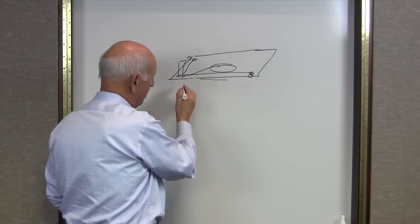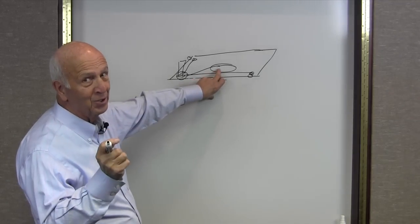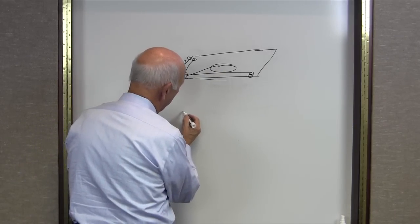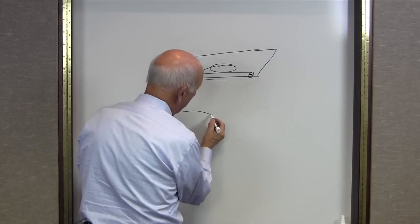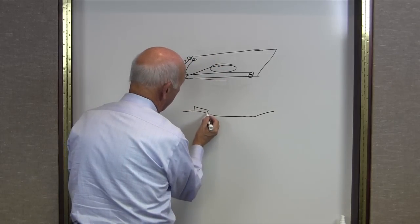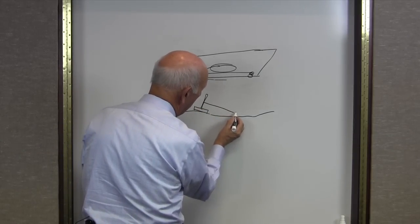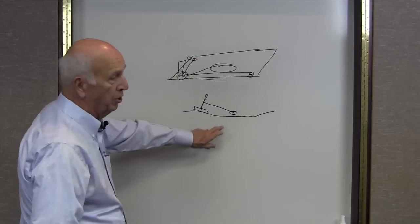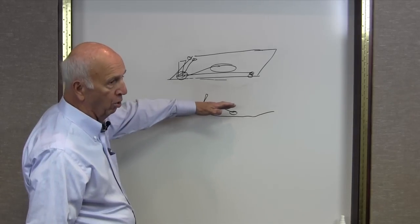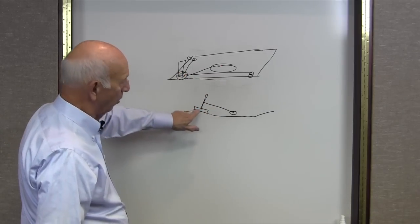The wear is going to be at the front edge and the middle. So we get a zero reading here or a zero reading here. When we move to the middle, keeping the indicator stand right here, if there's a hole there, this should be low — but not necessarily. What if your surface plate was really dipped right there in the corner? You put your stand on there — this is exaggerated — but your stand is now tipped. By the time you come out here to check it, it's going to show plus, because it's tipped.